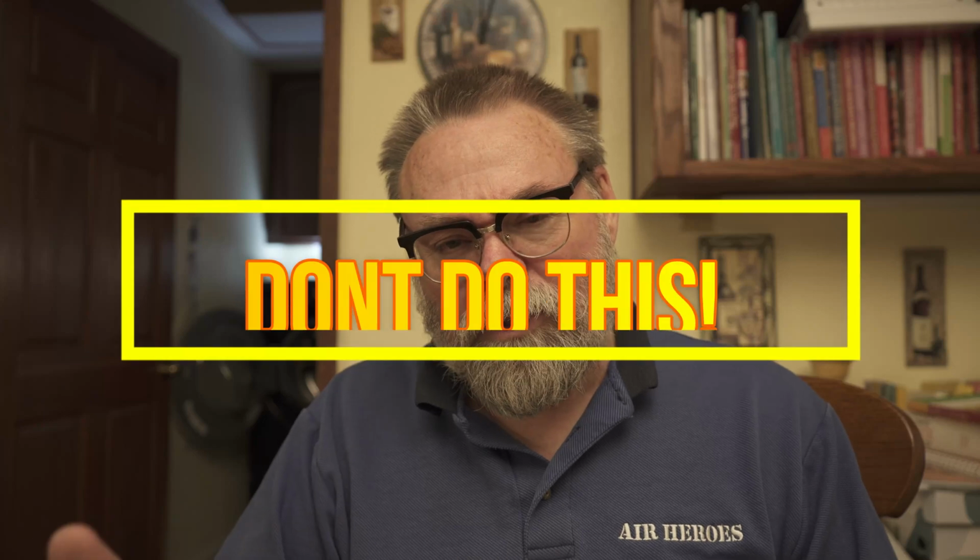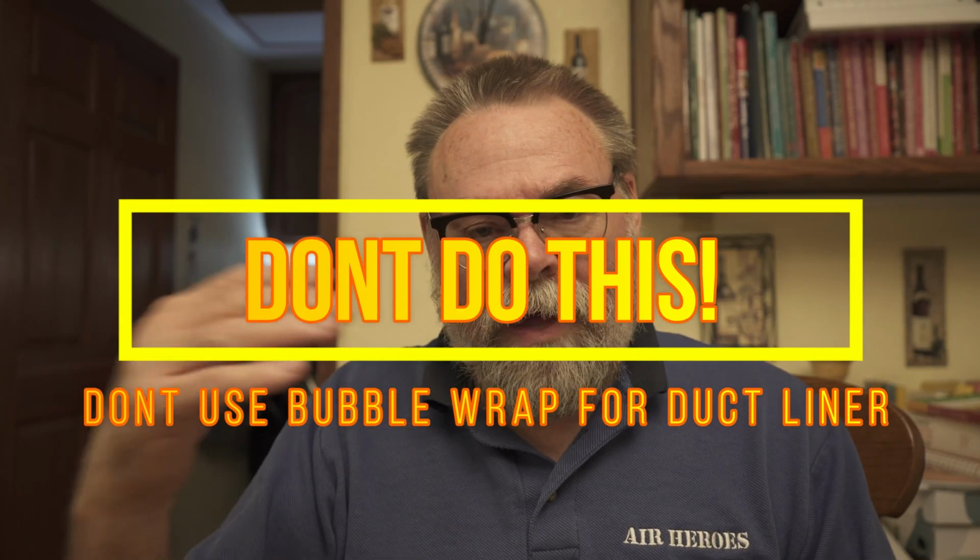And I asked, was this lined? And they said, yeah, it was lined with that astrofoil. Well, the problem there: astrofoil is not approved as a duct liner.